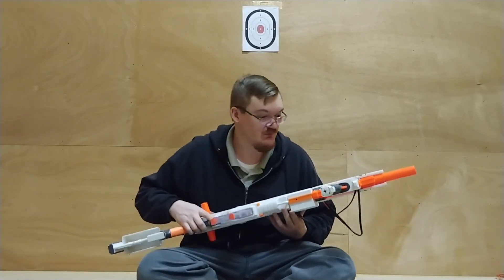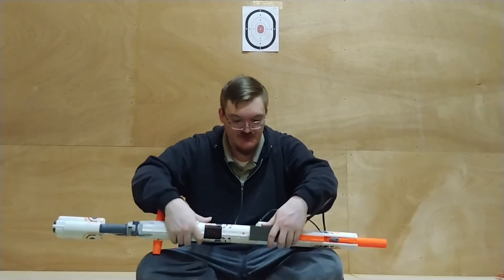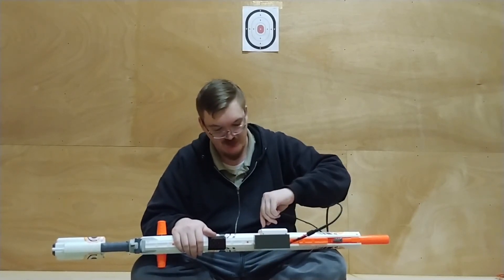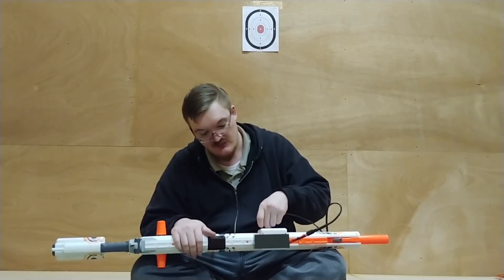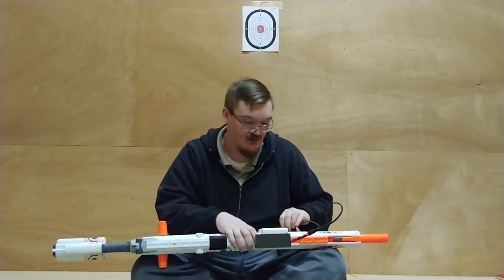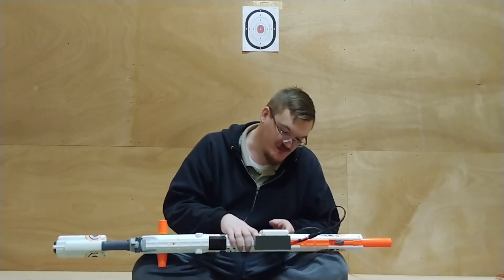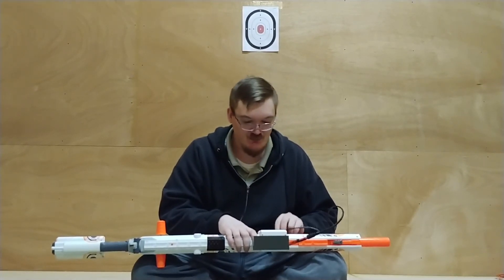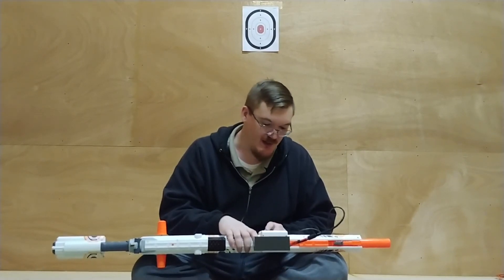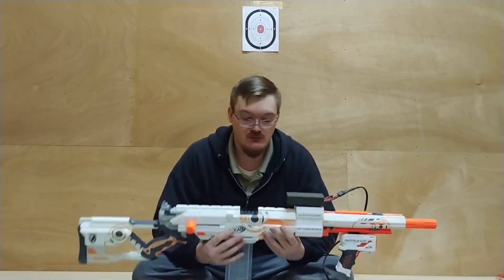Overall, I think it turned out fairly nice for how it looks. One more contention point: with as taut and unflexible as this wiring is, it's pulling the XT60 connector insulation off and eventually it's going to break that soldering connection. But that's not really Blaster Corps's fault — you either need a 90-degree connector, or maybe a secondary attaching point where you could solder on the front face and connect it directly in. There's got to be some other location you could put a power connector. But that can all be figured out at some other point. Thank you for watching, and that's all.